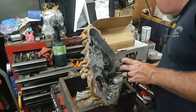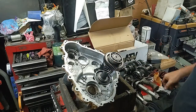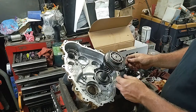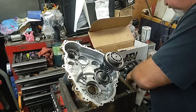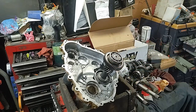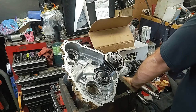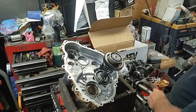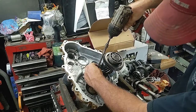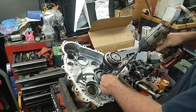I've got to get this plate on here, but I'm not real sure that the plate is going to clear the gear. About 99% sure that's not going to work - I may end up having to take this thing apart. I am going to have to pull this gear out. It takes a 5mm Allen, and most of the time these things will have Loctite on them. Hopefully my impact is going to break it loose. This has 4 bolts on it.